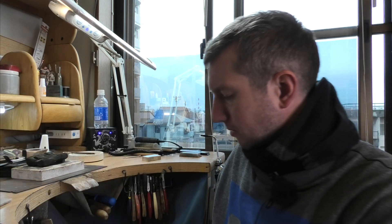I've learned from previous videos where I stress tested solder joins that sometimes rings just stretch up and up and I run out of space on my ring stretcher, so I'm starting with a really small size this time. To keep it fair, both rings are made from the same strip of metal, they'll be the same size, and after I solder them up I'm going to fully anneal them — starting from square one. The only difference is one done with solder paste, the other with conventional solder.